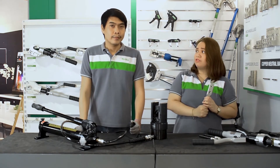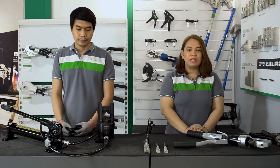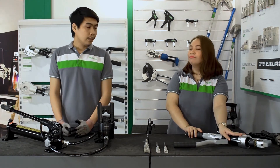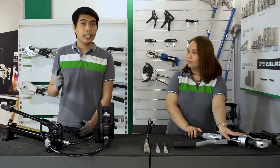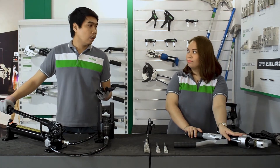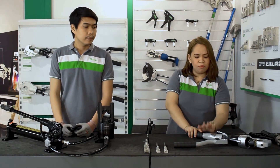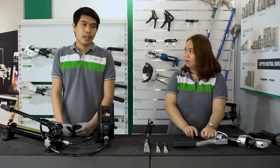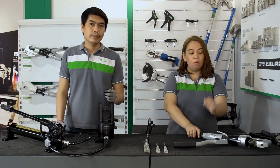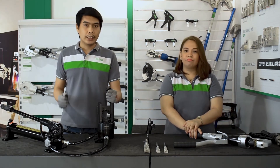Looks simple and easy. I just have some questions. What are the common problems or concerns normally encountered with hydraulic crimping tools? Usually, over time and with use, there can be oil leaks — this is normal in small amounts. But when the tool stops pumping effectively, it means we need to replace the oil bag, or refill the hydraulic oil if the oil bag is still okay. The hydraulic oil to use is hydraulic oil number 15, and it is available locally. What if a brand new unit has an oil leak? The most probable cause would be the sealing ring, and we just need to replace it.